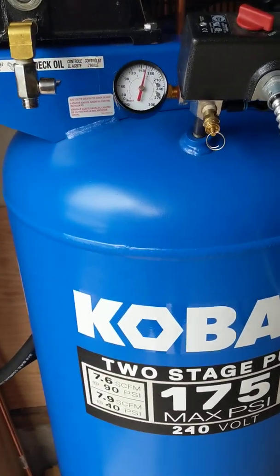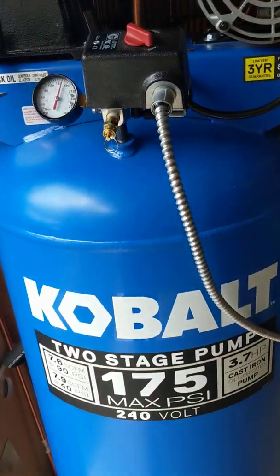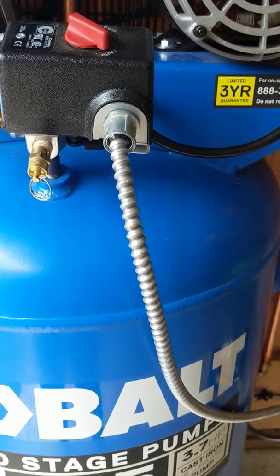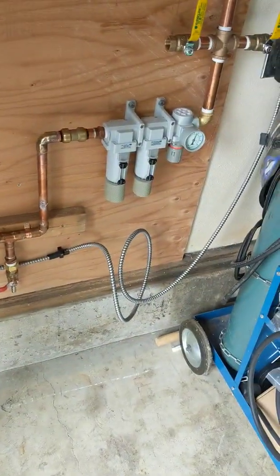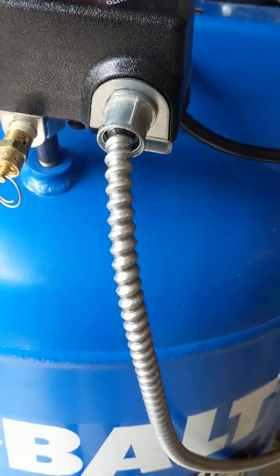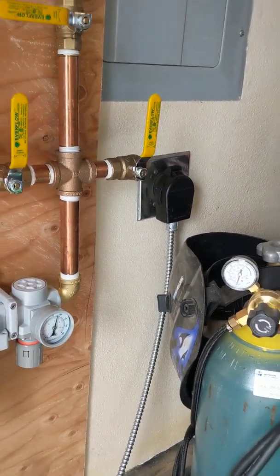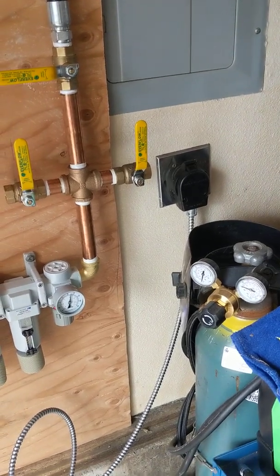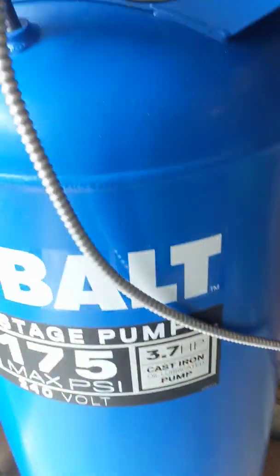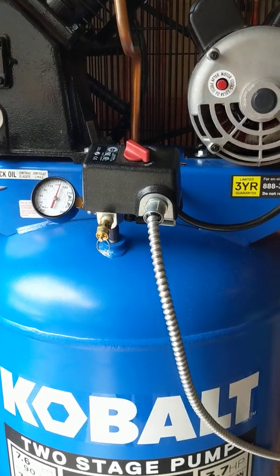Out of the package from the store it comes very basic — no fittings, and it doesn't come with the electrical connection, so you will have to wire that up. What I did was purchase a 12-foot long three-wire cord already inside conduit, with a strain relief at each end, and then I bought the proper three-prong connector — this one's the 240-volt 50-amp plug head.